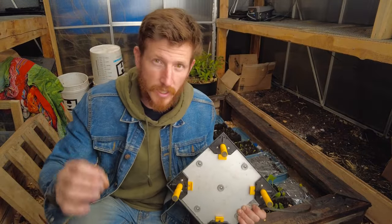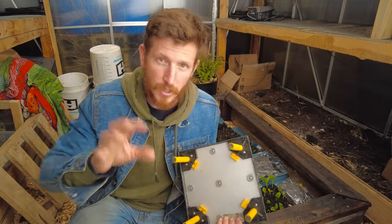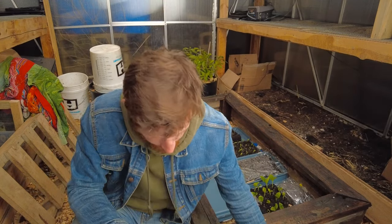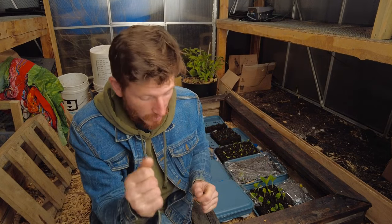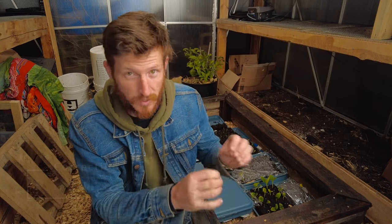The good thing about heat plates or heat mats is that because it's just a coil running inside them, the chance of a fire is basically none. They only run about 12 to 15 watts, meaning I can run one reliably throughout the night on my charged solar battery with no problems, even on a smaller solar generator. Heat lamps for brooder setups, on the other hand, run about 70 watts, which would only give me about two to four hours on my system. But at 15 watts, I have plenty of time — around 15 hours — to run these through cold snaps.